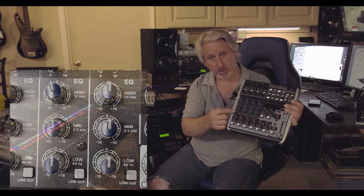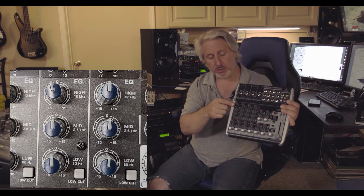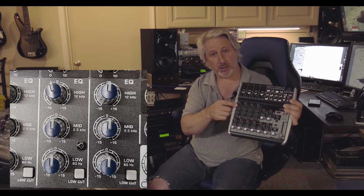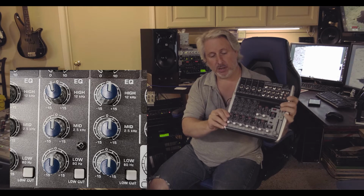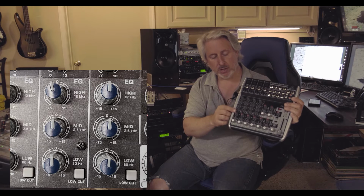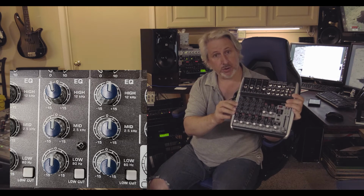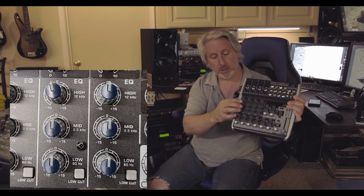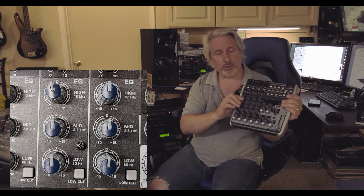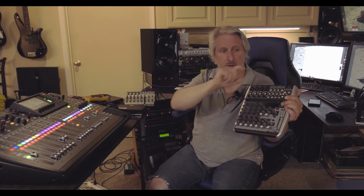This is the low knob, the bass, like the bass in your car stereo or your home stereo. This is the high knob, right? This is at 80 hertz and 12 kilohertz, right? 12,000. And then this one is about 2.5 kilohertz or 2,500 hertz is the same thing, but they're fixed. So all you can do is boost or cut, over here, or in the middle here, or over here.